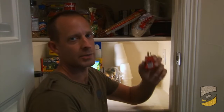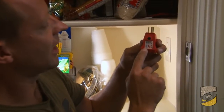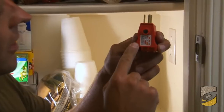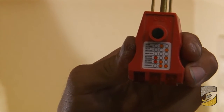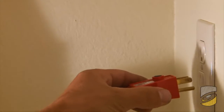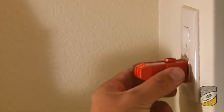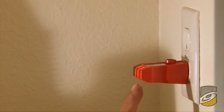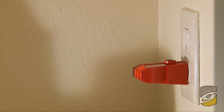There's your receptacle. It's always good to test the receptacle after you've installed it by using a plug tester. You can get these at Home Depot or Lowe's for about twelve dollars. You'll see a diagram of various kinds of wiring — open hot, open ground, reverse hot and ground — with lights indicating which one it is. Simply install this in the receptacle, and you can do this throughout your house for safety to make sure everything is installed correctly. As you can see on ours, it is installed correctly — the two right-hand lights are illuminated.